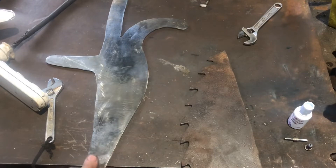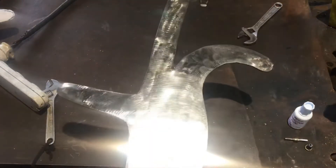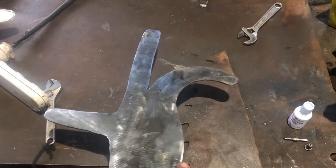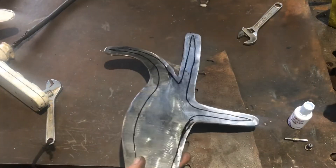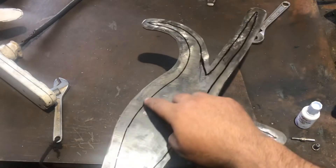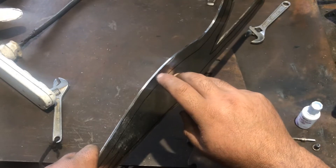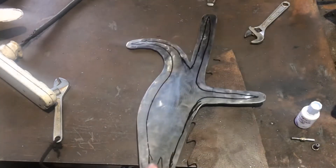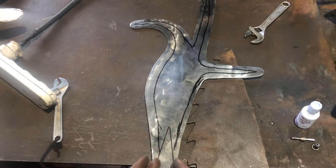When we're making a weapon like this we need to think about what we want it to look like. I've given it an 80-grit sand and we've got most of the pitting out — there'll be a little bit left. As we do the bevels, along this line here we're going to bevel that down to make a 2mm edge all the way around, and then we'll come back and put in the shaft holder.